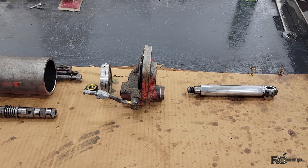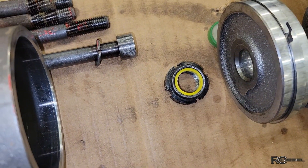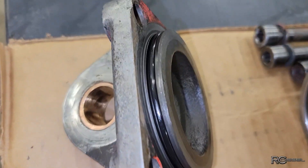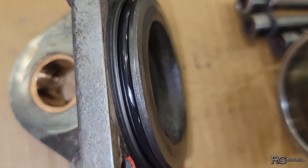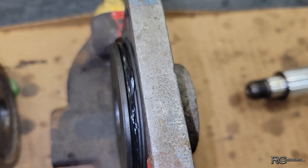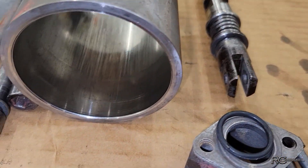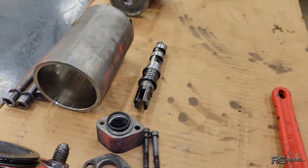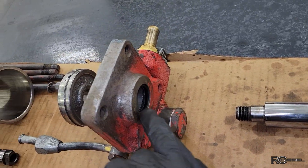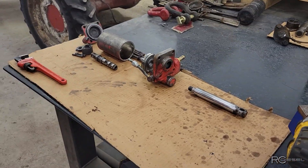So we have to take it apart and find out what seals we need and get them matched up. I didn't have the exact right spanner tools so I used my handy dandy adjustable spanner tool. This is the end that was leaking and this O-ring actually looks pretty nice, but on the other end this one is quite torn up — pretty flat, so that'll be why it was leaking. The cylinder inside is pretty scored, so I'll give that a quick hone to clean it up nice, replace the O-rings, rod guide and seal, and it should go for another 30 or 40 years.